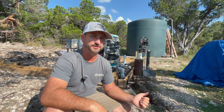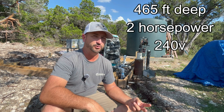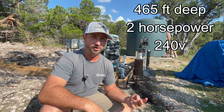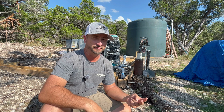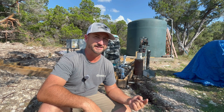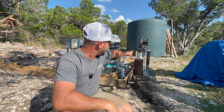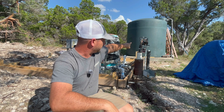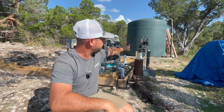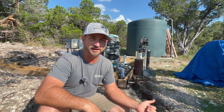This well pump is about 465 feet deep, it's two horsepower, and it's 240 volts. That's what you're going to want to know first. You're going to want to find the specs of your well pump — you should be able to find some of those specs on the inside of the power box or where the transformer is. You can see it opened up right there where those yellow, red, and white wires are — there's a contactor there. Inside that cover, I found some of the specs I needed.